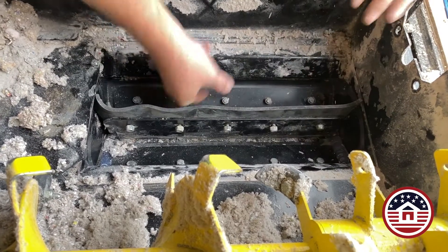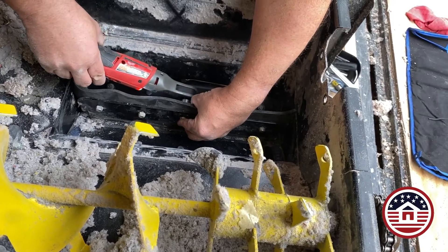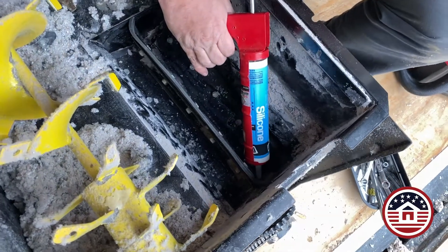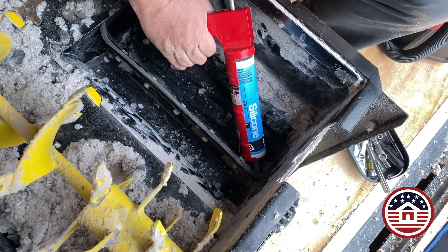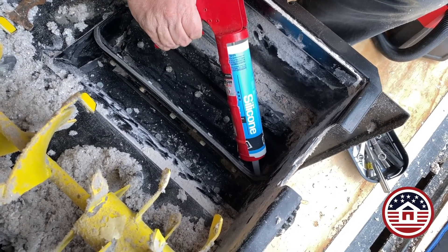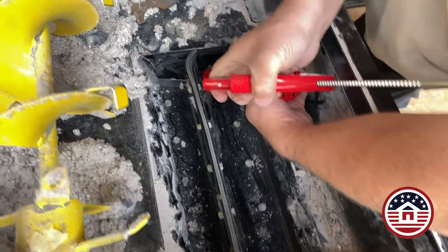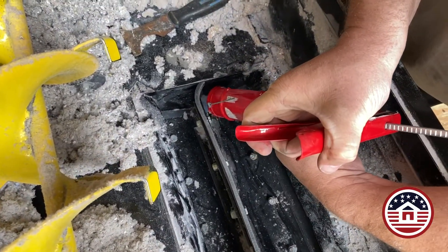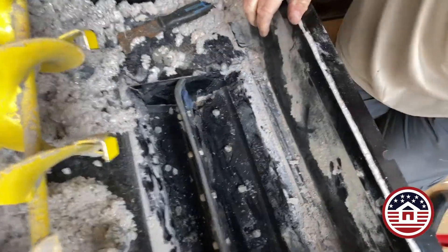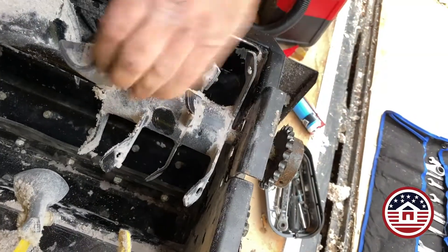One of the things you want to be careful with, especially using power tools, is not to tighten this so much that you end up warping the seal. As you can notice there's a little bit of curvature — we fix that and straighten it out. Now we're adding silicone right along the side of that plate where the metal plate and the seal meet. That will help produce a little bit more sealant to produce higher PSIs. Just a couple of little lines there.